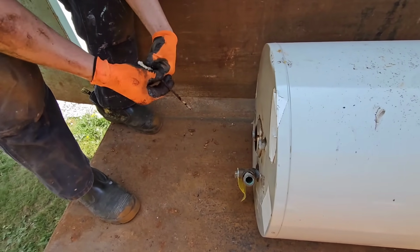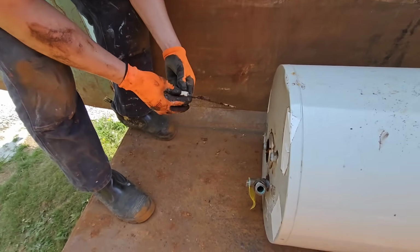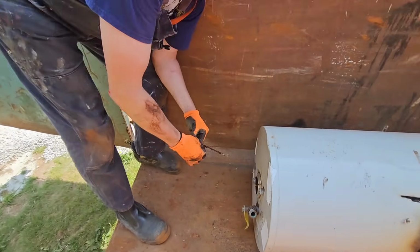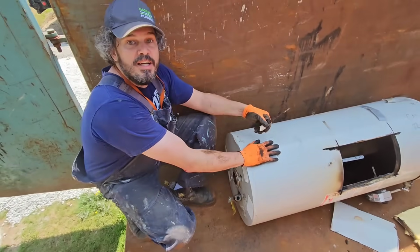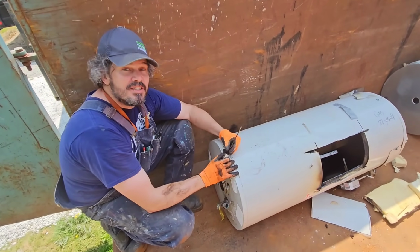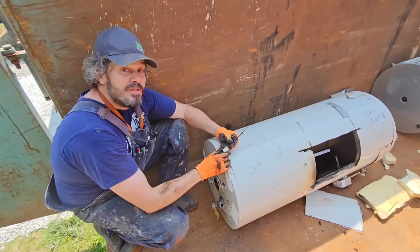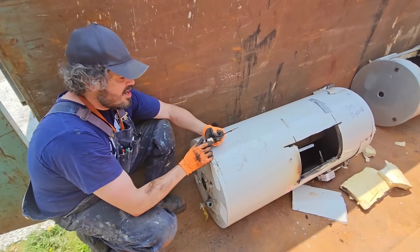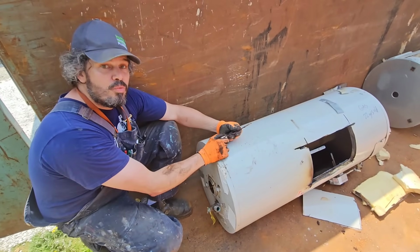A lot of people wait for their hot water tanks to leak, but you go through years of drinking this deterioration. The thing about them is the manufacturers warranty these hot water tanks for 6 years. And Bradford White just doesn't sell hot water tanks where you live. They sell them all across the nation. They're all built the same. So these anode rods are designed to cover kind of like the worst aggressive water in the nation.